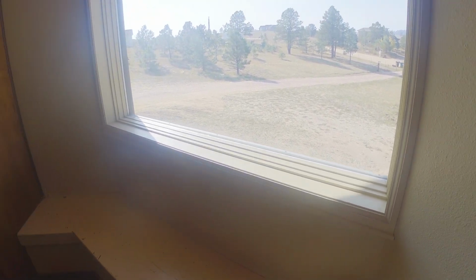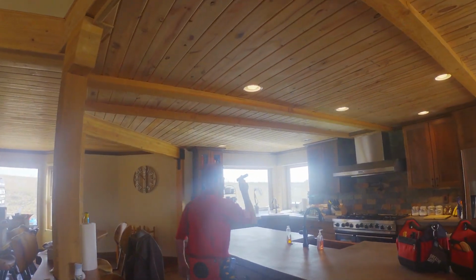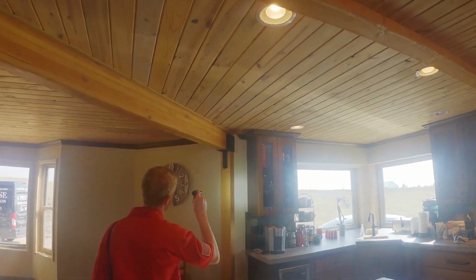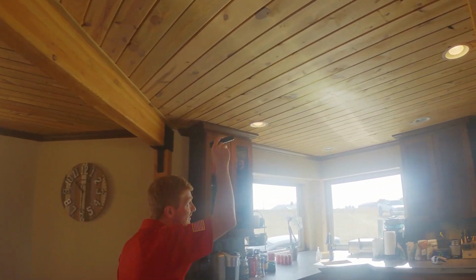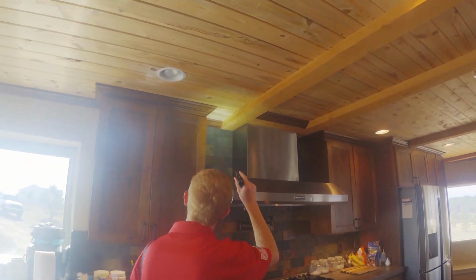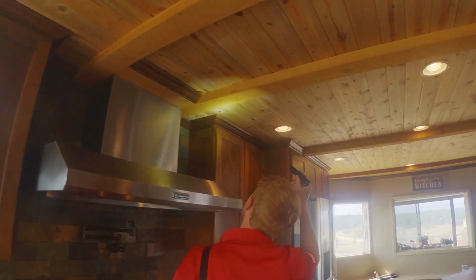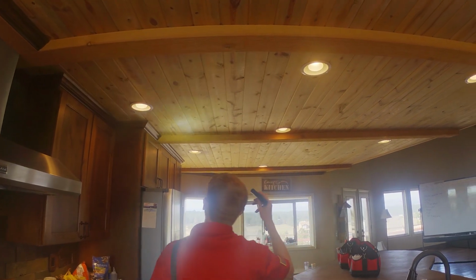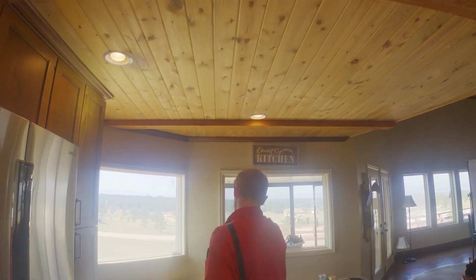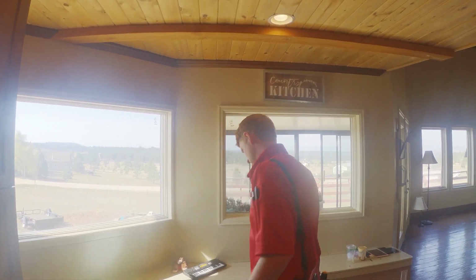During your inspection, you may have some hazards. Don't want to trip over this happy guy here. A tip that I would recommend for every inspector to do in every room is when you are done, to take a very good flashlight and white light all of your ceilings and maybe even your exterior walls. This ceiling might not show a whole lot because it is wood, but on a drywall ceiling, we regularly find moisture stains and leaks that we were not able to see until we shined a very bright white flashlight at it. All of our inspections, when we're done with every room, this is the last thing that we do, is that we white light our exterior walls and our ceilings.